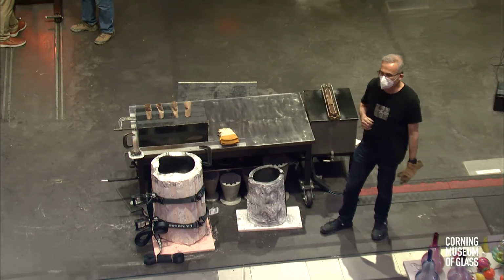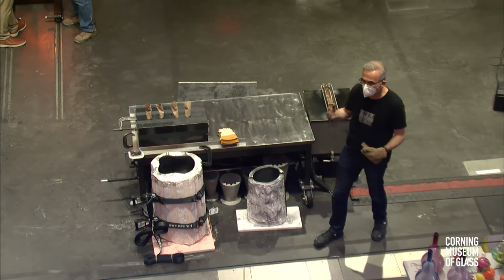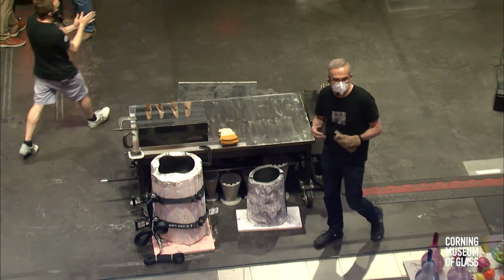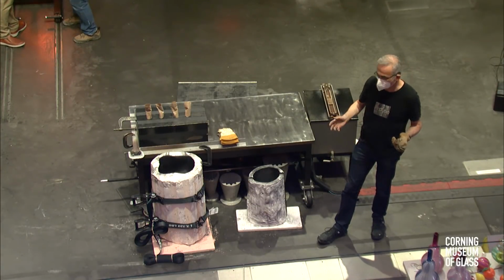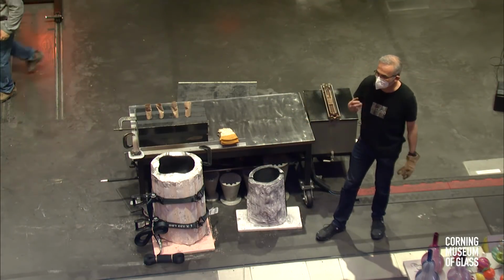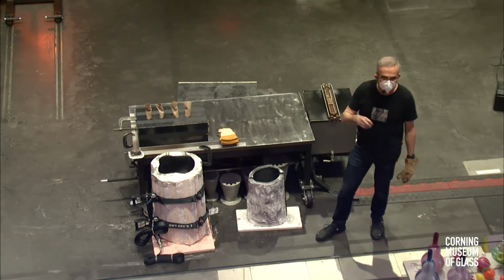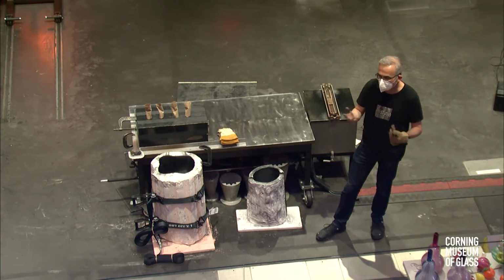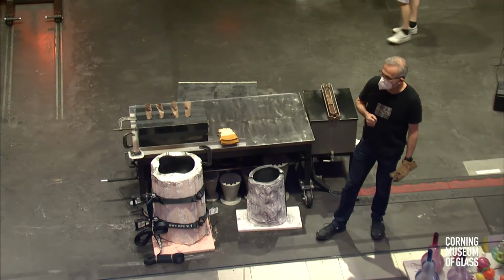There's a lot of pressure under there. In the foundry process that I use, plaster is not good at sustaining heat, so I need to cut it with something. It's a great modelling material, but if you heat it up in a kiln, if this whole mould got hot, it would just crack and fall apart. It would recalcine. So we add silica flour to that, very finely ground silica, which is basically glass, and we cut that sort of 50-50 with the plaster silica, and that allows the plaster to go up to temperature to that 1500 degree mark and hold its shape.